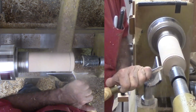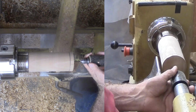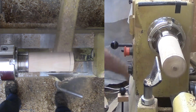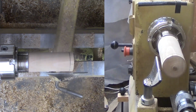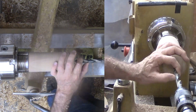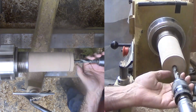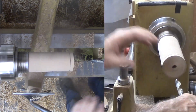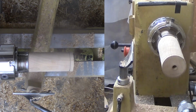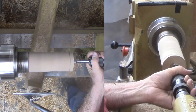I intend to work the foot first, but I reverted to the typical process, that of turning the goblet portion first. The gumwood is hard. I'm using the machinist technique to drill my hole. I'm drilling first with a 3/8 inch drill, then a 1-inch Forstner bit, and then the final Forstner. This is all in line with the axis. I cannot risk any lateral pressure.